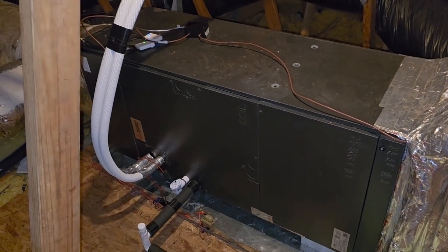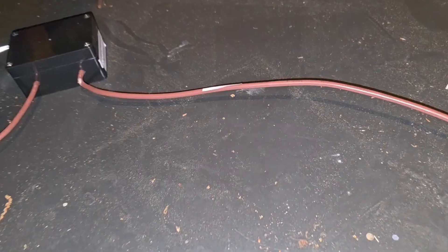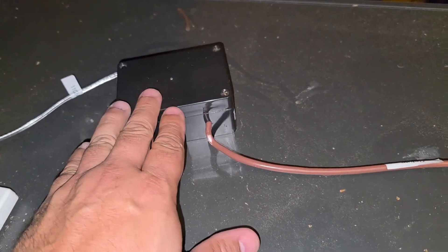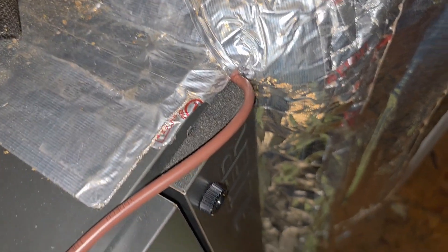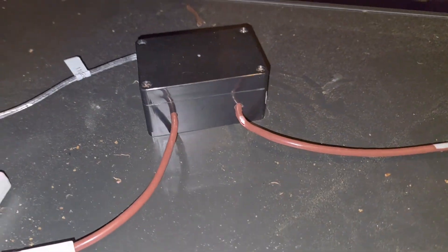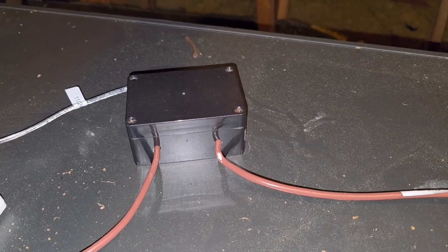This is the air handler that we're going to attach our temperature and humidity sensors to. This is a Mitsubishi P-Series multi-positional inverter air handler. Here's the indoor module, and there are two sensors connected to the Shelly module inside. There's going to be a return air temperature and humidity sensor — you might drill a hole in your duct to put the sensor in there, but we were able to fish it through and get it in the return. This is before the coil. We also have a supply temperature and humidity sensor that we fished through the air handler, and that is in front of the coil. So pretty much all we're trying to do is get a coil entering and leaving temperature and humidity, which is going to help us to calculate the delivery capacity.